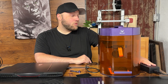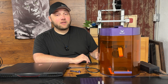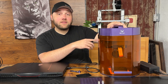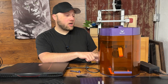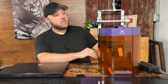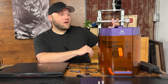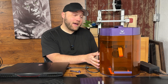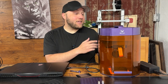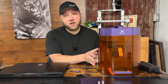If you have a green light on your power supply, it's plugged into the base, but nothing's happening, that could be because the contact points aren't touching or there could be something wrong with the power supply or the port on the back of the machine. Take the plug out of the back of the machine and plug it straight into the head of the unit outside the base. If the head turns on, the port on the base is bad. If it doesn't turn on, the power supply itself is bad. You'll have to call xTool in both scenarios — they'll likely send out a replacement unit.